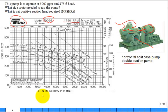We talked about how you characterize it by the flow rate and the head, and you have performance curves depending on the size of the impeller that's enclosed in the case. Nowadays, you basically get the impeller that's going to give you the best performance, and you really don't change the impeller size much. You could still change it, but you would pick this one, and it seems to have pretty good efficiency, and you'd want to operate around this best efficiency point. Here are your efficiency lines coming like this, and it'll operate fine over in here and off to the side, but you really don't want to go way down in this region. And yes, sometimes you can deadhead a pump and it'll run, but it's just going to be like an egg beater, and it's going to heat that water up and heat everything up, and you just don't want to do that for very long.